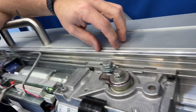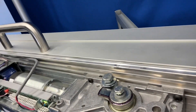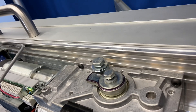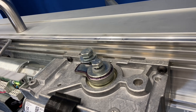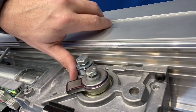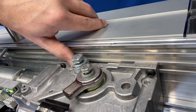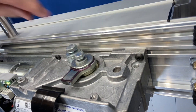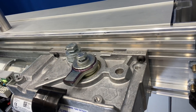Then I'm going to allow my door to close just a little bit. In my case I'm going to let it close all the way, and then once it moves off of that I will adjust my stop block around to the fat side. Then I will tighten it down and my stop is set properly.